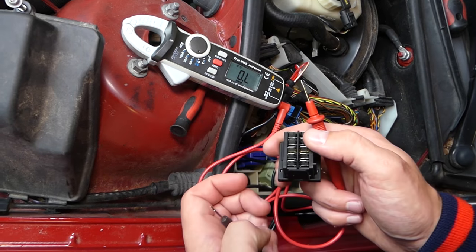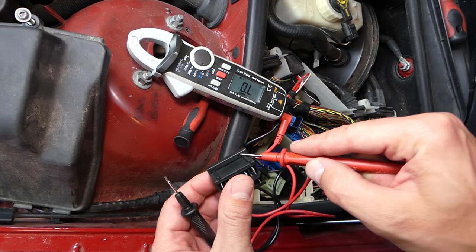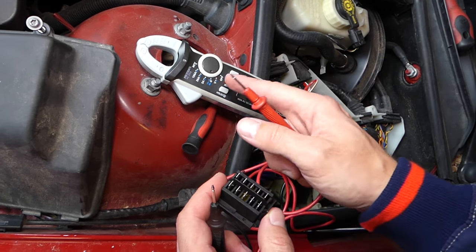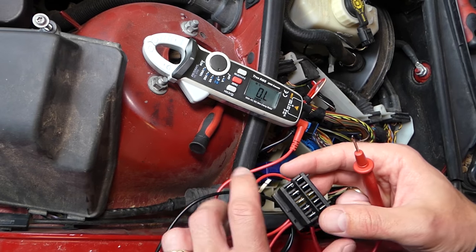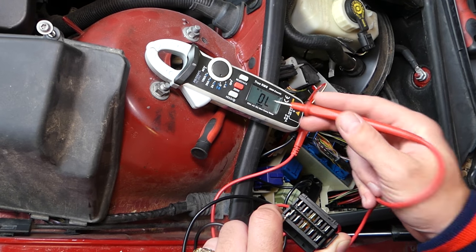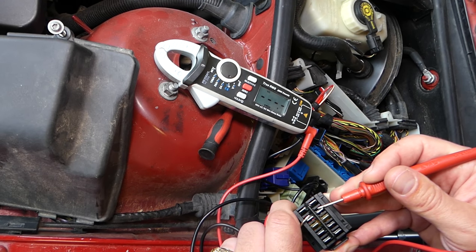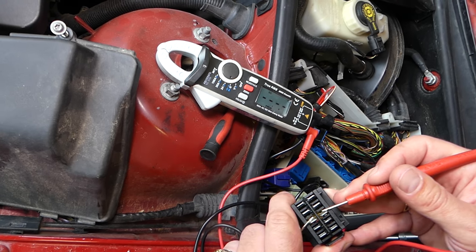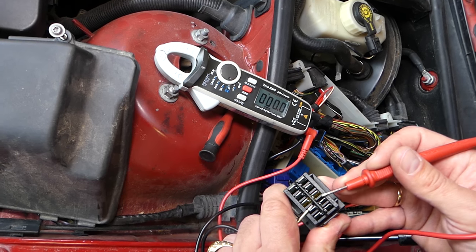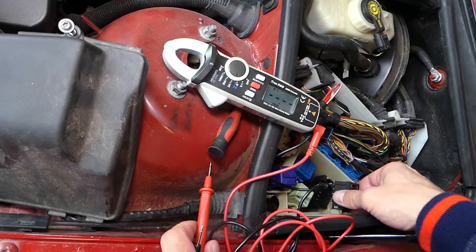I get a voltmeter — these are individual fuses you can replace by opening that cap. You slide back two things and you can open and replace the fuses. But I set the voltmeter to continuity testing and test each fuse, because these are super important. If the fuse is good it will show near zero. Check this out — zero on this one, zero on this one again. So far those fuses are good, no problems here.